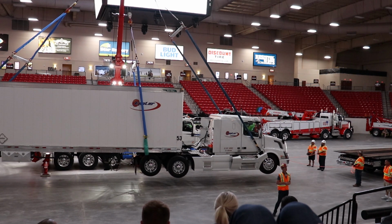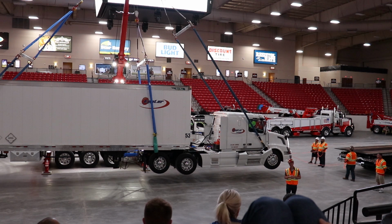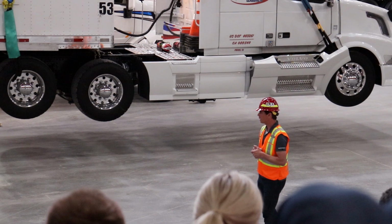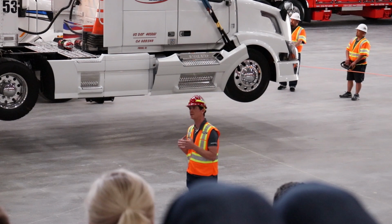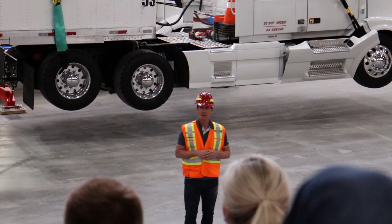But in California, you've got to permit your truck, and this one is currently permitted with the proper permit in California. This truck, to be permitted in California, has to be less than legal. Now this one, because of its wheelbase, was designed to work in an environment where they wanted to keep the turning radius good and the maneuverability as well, so it has been designed with a little bit shorter wheelbase. There are a couple of regulations, but that wheelbase set the maximum gross weight for that vehicle at 60,500 pounds. I'm not going to lie, it was very difficult and tight. We're about 200 pounds short of that 60,500 in proper working condition like it is right now. So it's about 60,300 pounds as it sits with the equipment in it.